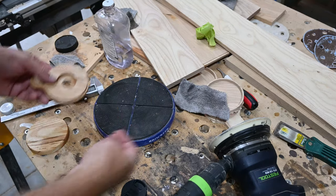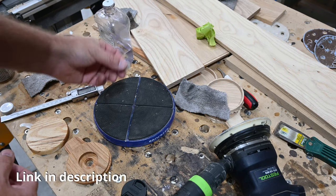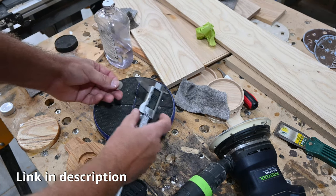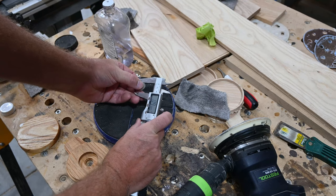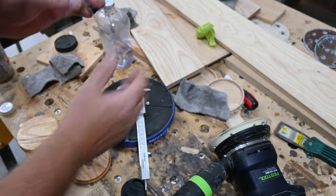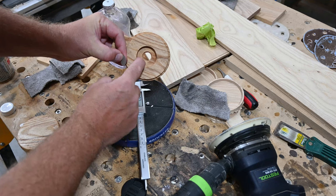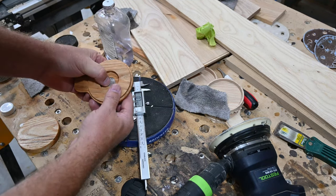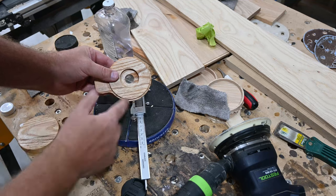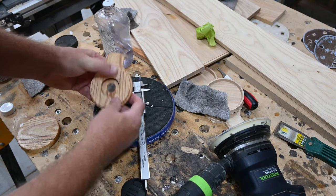When you're done with your mineral oil or whatever finish you want to use, it's time to pop in the little stainless steel pipe screen. I bought these on Amazon — I'll leave the link. You may want to double check before you carve these out what the actual diameter of these is. I'm looking at 0.746 inches right now. If the screens you buy are different, measure them and drop the size of the hole by about a thou so they just pop in and stay — it's a pressure fit. Never put glue in these things because that could make the whiskey taste bad and it's probably not good for your health.